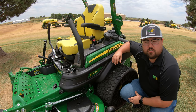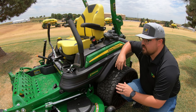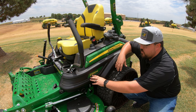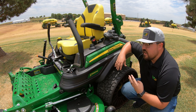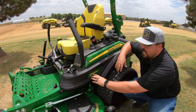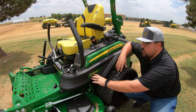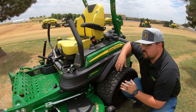Let's talk a little bit about the model number, as in the John Deere mower lineup there are tons of different model numbers and those can get confusing. On the Z960M, starting with the first letter Z, this is the broad indicator that this is a Z-Track mower. The next digit is your series indicator — within Z-Track mowers we have Z3s, Z5s, Z7s, and Z9s, which also indicate a commercial mower. The last two digits within the Z9 lineup indicate engine size and specific features. With 60, we're at the higher end of that Z9 spectrum; the only model higher is the Z970.